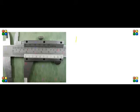In this second example, we'll just put the steps as numbers and look at the 0 right where I highlighted there, and it's 17 full millimeters. And the slide, we're going to find it. You have to look carefully again, and we find that it's at 0.64. We got the 6, and then 2 notches after, lines up.